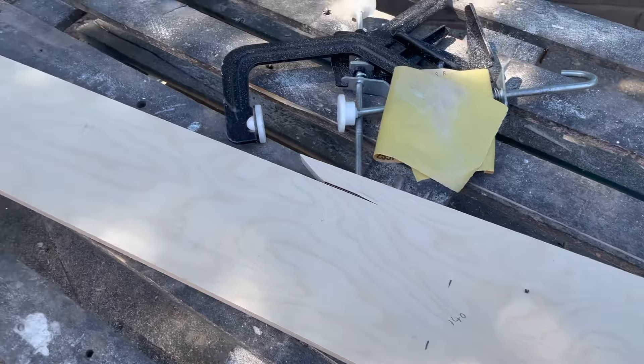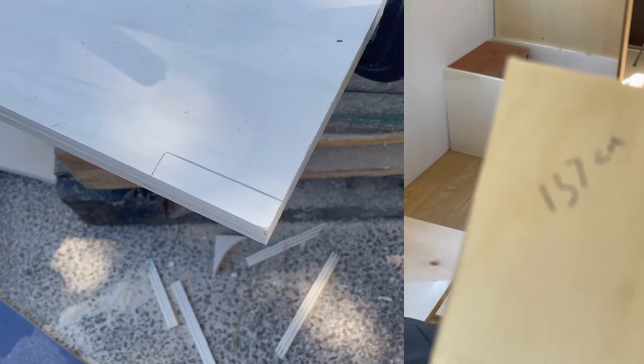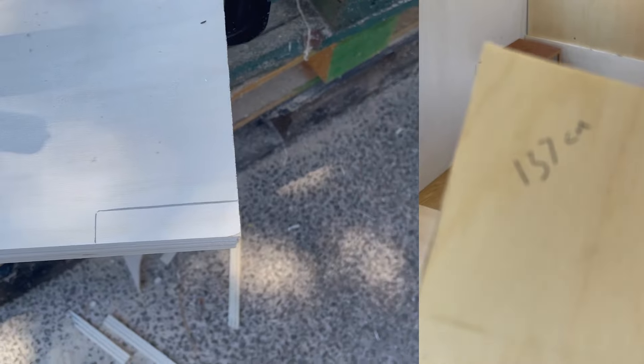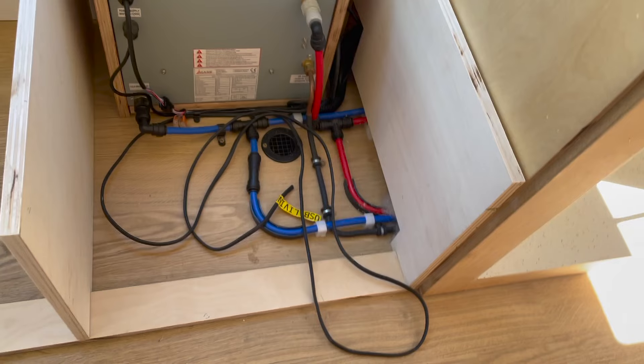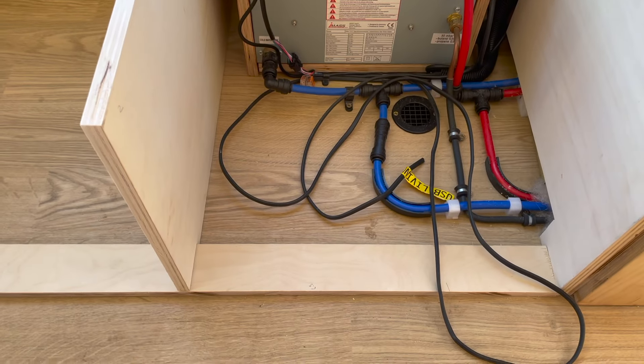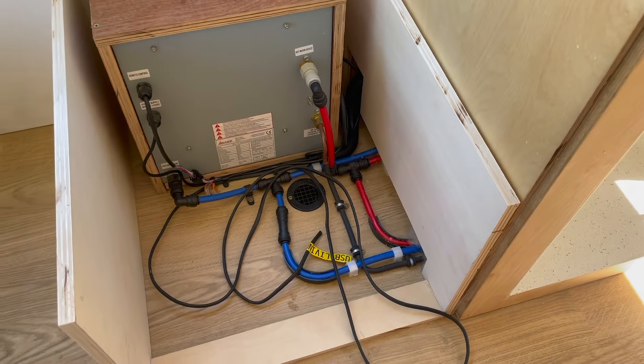This offcut was used to make the bottom support section. I decided to wedge out the bottom of each of the side pieces and then cut a 137 centimeter piece that sat along the entire bottom. This is going to provide horizontal structure as well as a place to secure the bench down into the floor eventually.